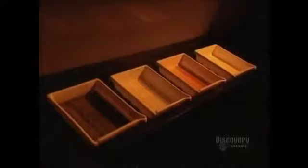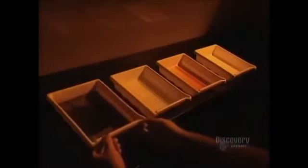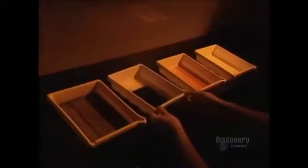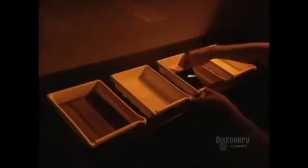As in photography, the film has to be developed. These trays contain different chemical solutions and the developer. First, the film is soaked in the developer for two minutes. This solution blackens the silver salts which have reacted to the light. Then the film is soaked in a solution called bleach, to completely eliminate the silver salts which blackened it. The film is then rinsed to eliminate the acids in the emulsion and to not contaminate the next solution.